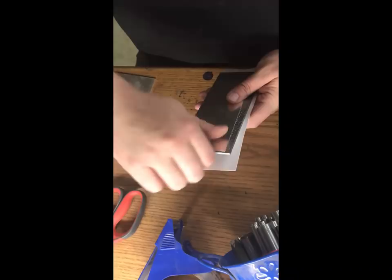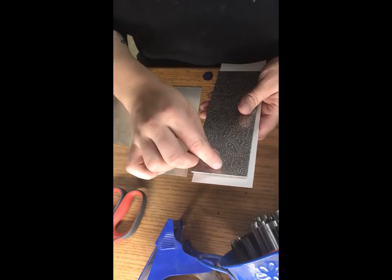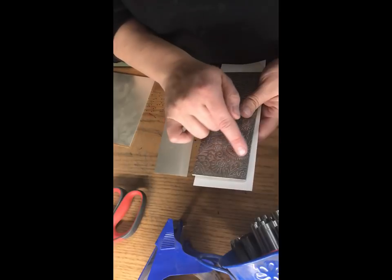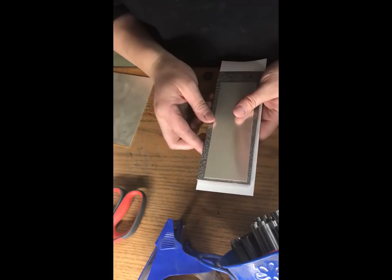When I close it with the silver, it's going to be tight, so I wrench it down as much as I possibly can. Then I untwist it, take the silver out, very gently close it down until it just touches the plate, and measure halfway in between. Halfway between where it was with the silver and where it's bare is exactly where I want my rolls to be set.